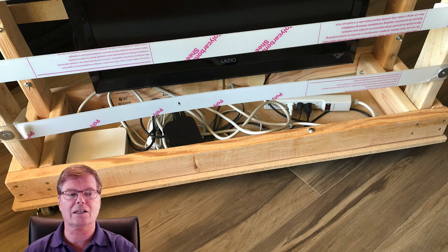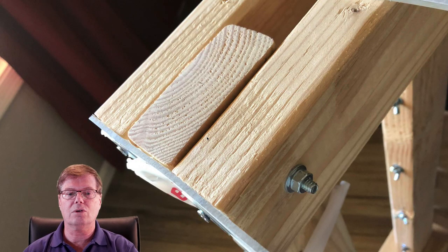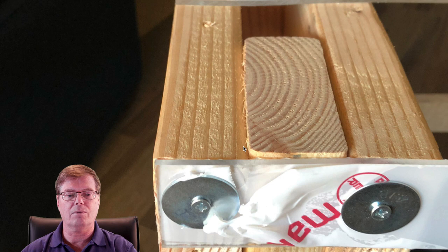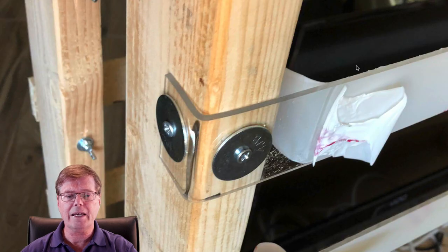You can see the top attachments — they go all the way to the edge, they're four feet long, not bent over, with one connector at the top. The strips stick out about an inch past the end on the uprights. I used a heat gun to heat the polycarbonate and bent it in order to go around the corner and attach it there.